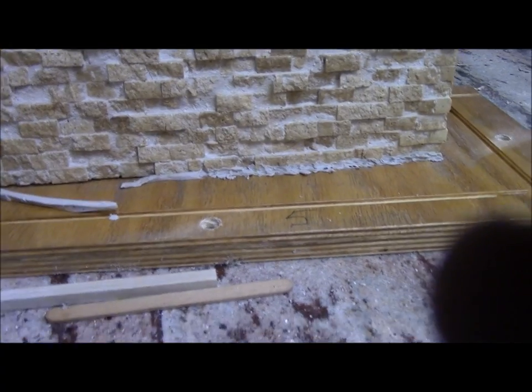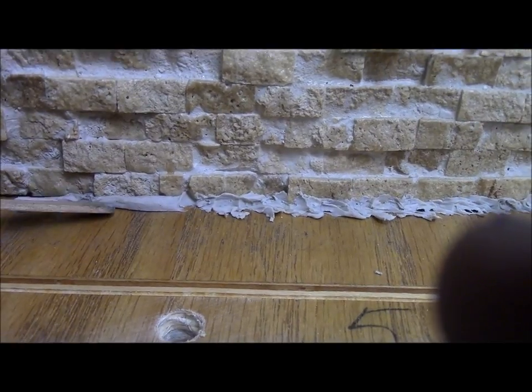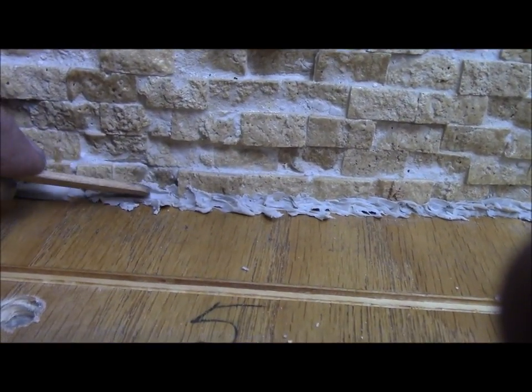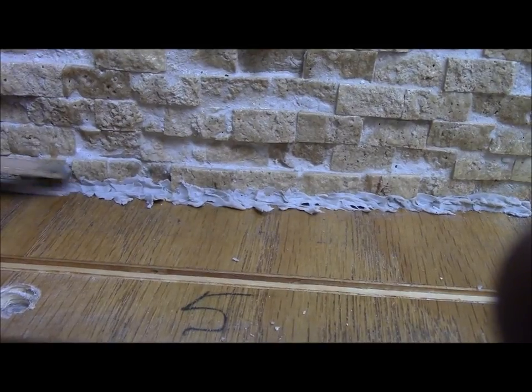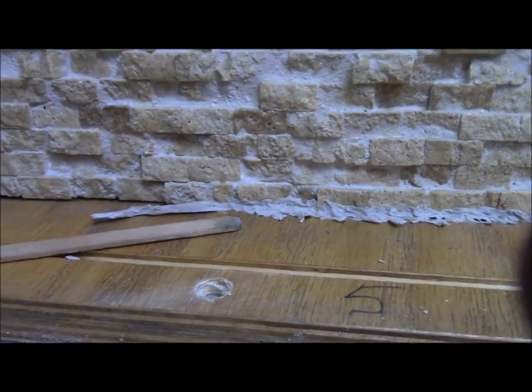What I'm doing now - you can see the clay there. You see there's a gap here. That can't be, because when you pour the urethane, you don't want the urethane leaking out. So what I'm doing is cramming clay in there, and then I'll trim it. All of this is for the purpose of maintaining the integrity of the urethane when it's poured, because the urethane will go everywhere. If it was allowed to leak, my level wouldn't be correct - the level of the urethane would be too low. I do it both on the bottom and on the top, all the way around everything.